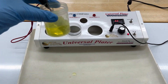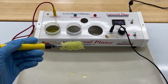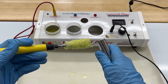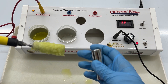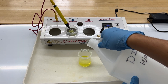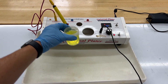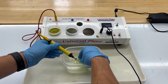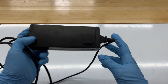As the chrome in the solution becomes more concentrated, the machine will start to pull more amps. When the solution gets too conductive, it will pull over the available amps of the power supply you are using, and as a safety measure the machine will short out. Once the machine has cooled down or reset, it will come back on but will continue to short out until you address the over-concentration. You can fix this by diluting your solution with distilled water or replacing it with fresh solution. If you are brush plating, rinse your used sleeve out with distilled water to remove the absorbed used solution.